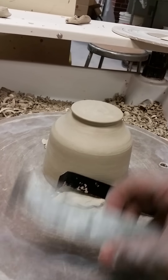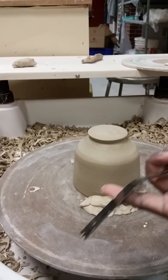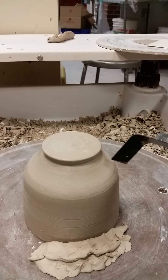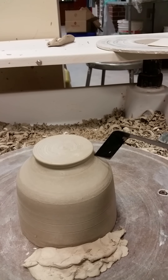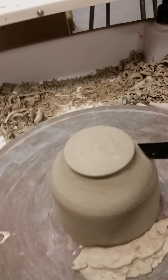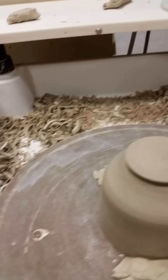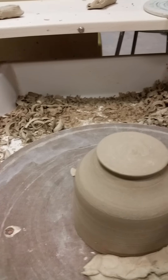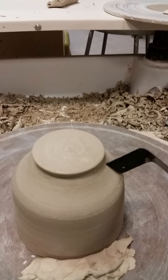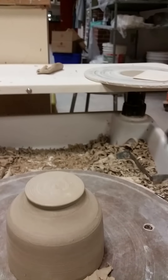I'm going to use this particular one and show you different types of chatter. The more pressure you put on one point at a slanted angle — I could just do the tip, I could do the whole piece, or I could turn it, and once I turn it, it'll change the angle of the chatter. If I'm pressing down much harder, you get a tighter chatter pattern, and the less pressure, I'll get a lighter pattern.